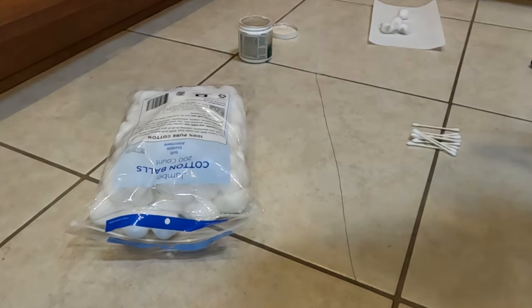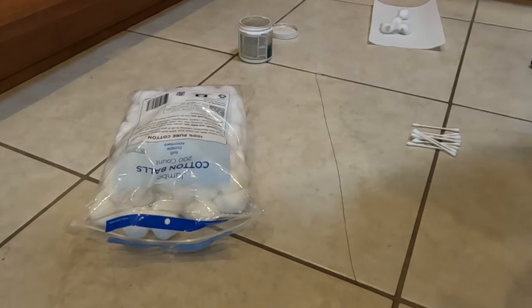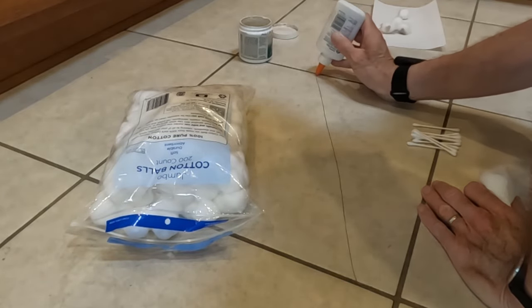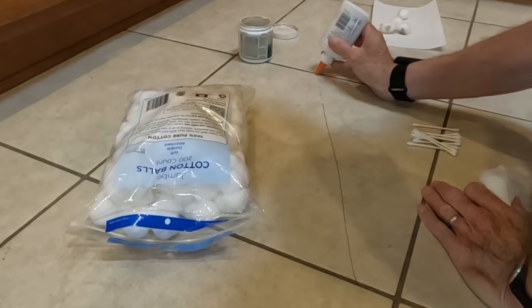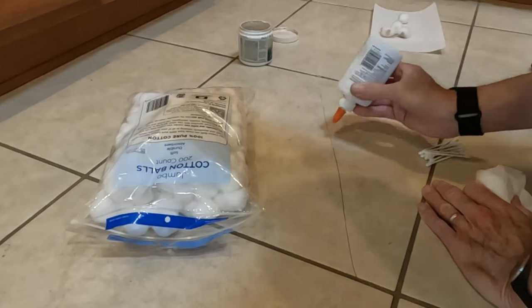This one might be even better, but the top broke. So what you do is open this up to the fine point. You want to get some paper towels ready. What you want to do is fill the crack with the wood glue. The wood glue turns clear when it dries. You can see it's a little white when you first apply it. I'm going to wipe off the excess — I want it to sink into the crack and help fill it.